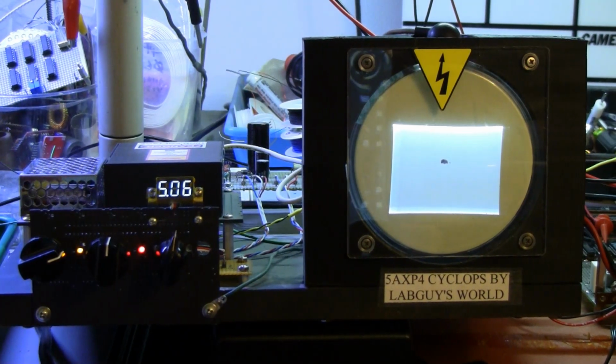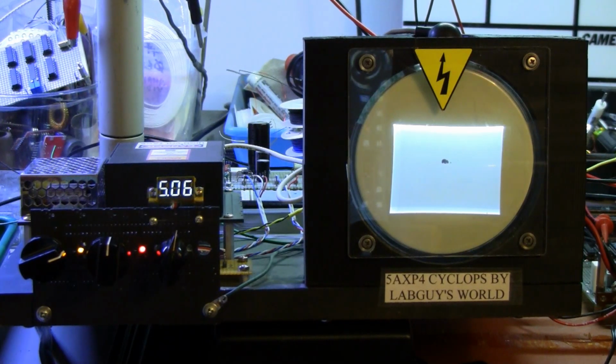So there's one other feature that I've kept secret until just now because I forgot to write it on my script. But for the eagle-eyed among you, I'm going to tell you now. The blanking signal is connected to the grid of the electron gun, and we are blanking off scanning during the blanking intervals. If you thought that raster looked a lot more rectangular than it did last time, you are correct, and you are observant.